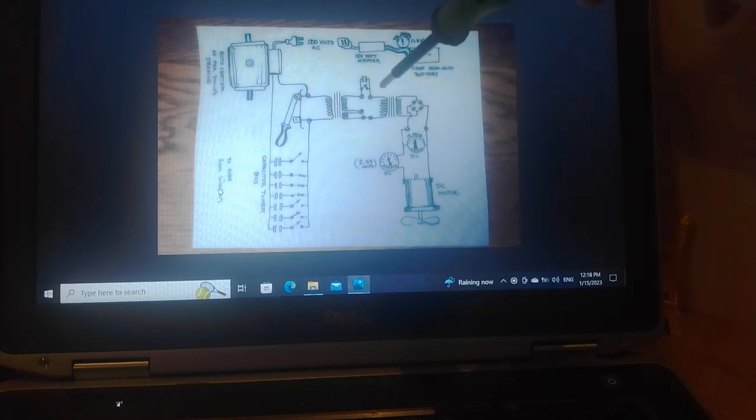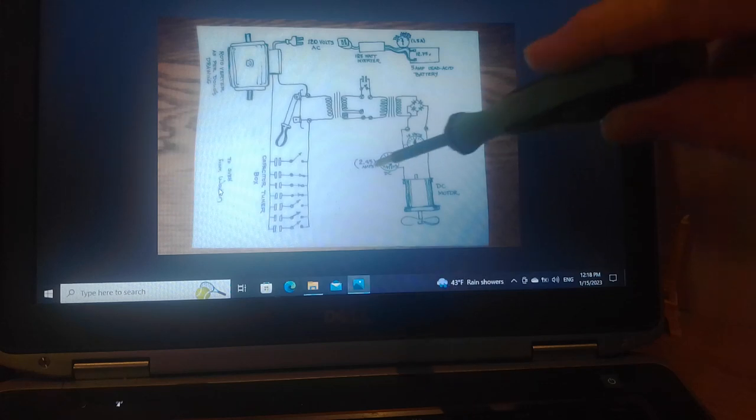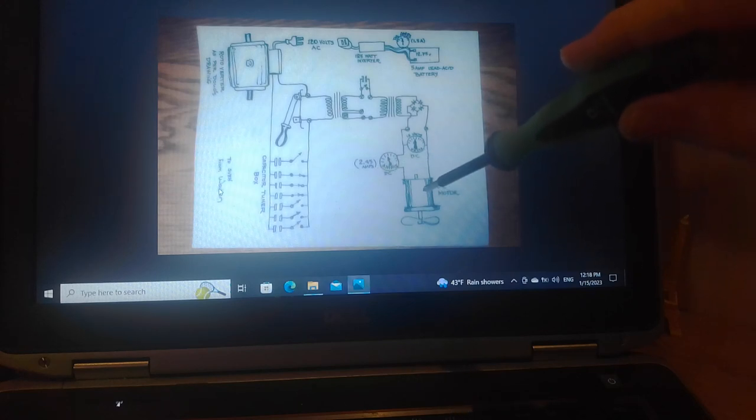And a guy, Dmitry, did a really good rotoverter, and he used two transformers, not just one. And he and Warren also put a cap here, so you're going to tune between the two caps with a series cap here too, and you put a little switch there. I guess when you want to kick in the load. And then you rectify it with a full wave bridge rectifier, 4 diodes. And so what he was getting out here is 16 volts DC, simultaneously, 2.45 watts, I mean amps, into a DC motor.